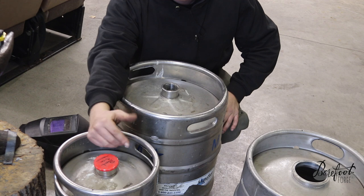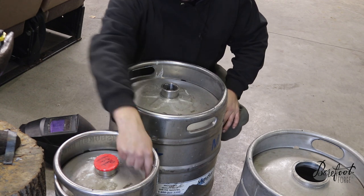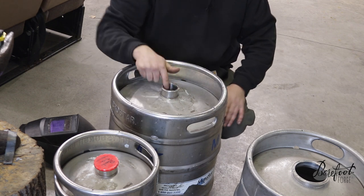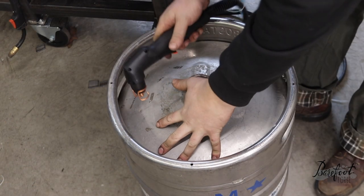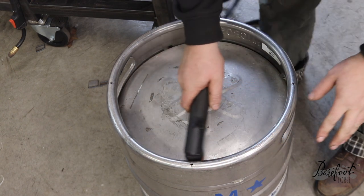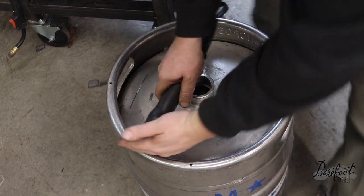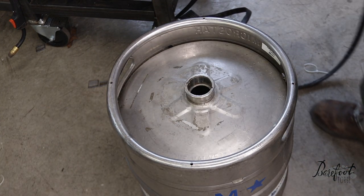If I just drill a hole and then treat it like it's a plasma operated scroll saw and just go from that hole, totally fine. This, on the other hand, we've got the spear out, plenty of ventilation. It doesn't look like I need to build any kind of special fixture, because if I just ride this along that, if I try to keep this level and I go all the way around, I should get a real nice even cut, as long as I keep this parallel to the outside. So I'm gonna have to move my body with it, but that should give me a nice cut.